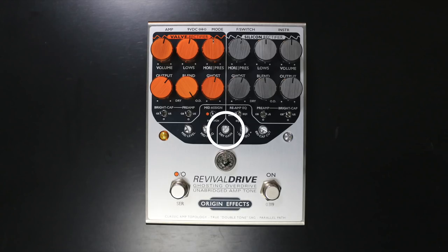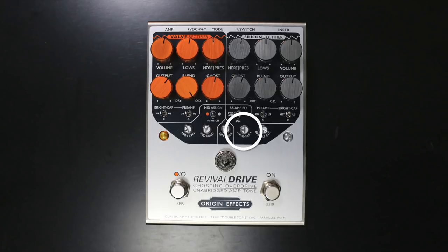The dry gain control is a universal control, exactly what you think. It adds gain, or allows you to attenuate the gain in your dry input, which is really handy, especially if you're doing more blending. There's another global control called the high shelf, and that's going to allow you to choose your high shelving frequency for the whole pedal. Once again, that'll apply to what type of amp you're using. Is it a really bright amp, a really dark amp? You can compensate there.